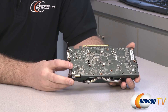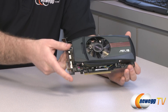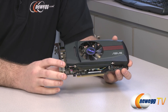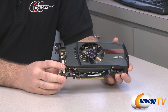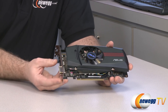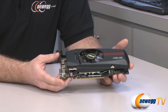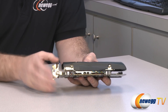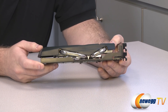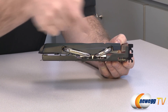This is the new GCN architecture from AMD, built on a 28 nanometer process from Taiwan Semiconductor Manufacturing Corporation. It has no fewer than 1.5 billion transistors. You get the aforementioned 1 gigabyte frame buffer on a 128-bit memory bus, and your GDDR5 memory is clocked at 4.5 gigahertz. You also get 640 stream processors along with the Direct CU cooling solution from ASUS, which features heat pipes that make direct contact with the GPU.